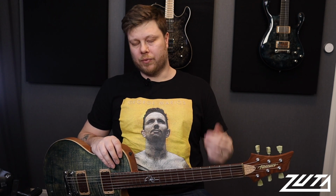And then speaking of the DI out, I want to demonstrate the reamping feature. We know all of that works. You record a clean signal at the same time as you record your original signal or whatever you want, and then just be able to send it out from the sound card back in through the front of the amp. I will mention that this amp has a separate transformer for the reamping circuit and a ground lift, so it's silent, it's easy to work with, sounds really good.